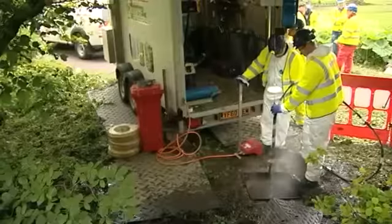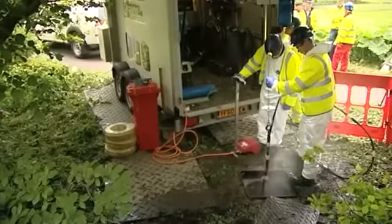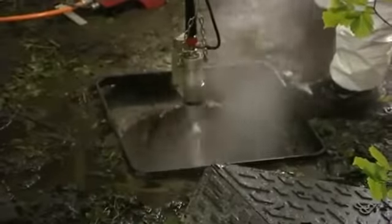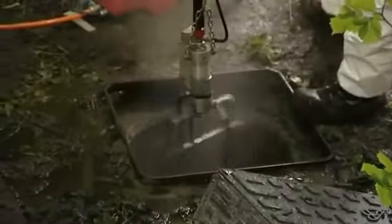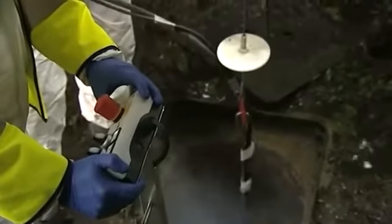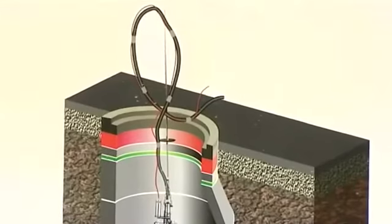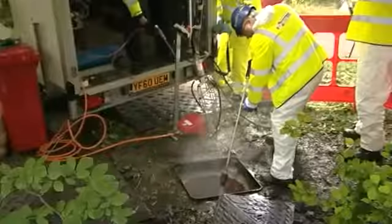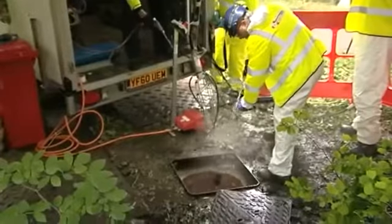In other situations, sandblasting media can be added to strip away existing coatings or to abrade hard or shiny surfaces like engineering bricks. There's also the option of a variable temperature hot box to ease the removal of oils, fats, greases and chemicals. The aim today, though, is to prepare the chamber walls for coating.